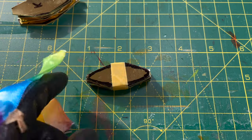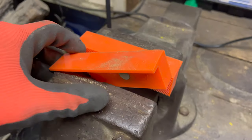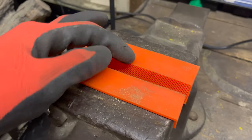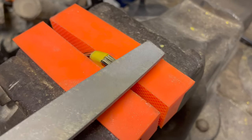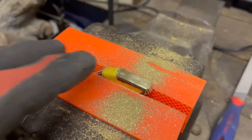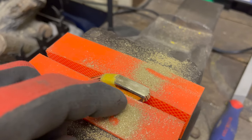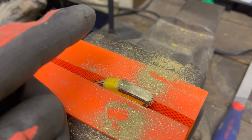This should be nifty — let's see if it works. Back to the workshop. We go to our little magnetic jaws fitted to our vice, and this should make sure we're not going to damage the brass. In they go, and we're going to file in nice up and down motions with a little bit of a diagonal direction, and we're going to reduce it in size until we get right down to the black line. And as a bonus, we create all this brass sand — make a little shiny beach.